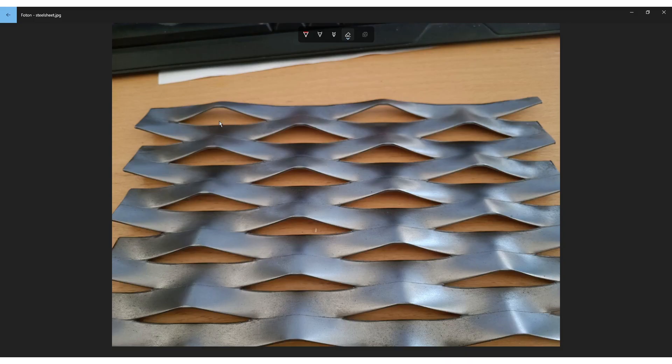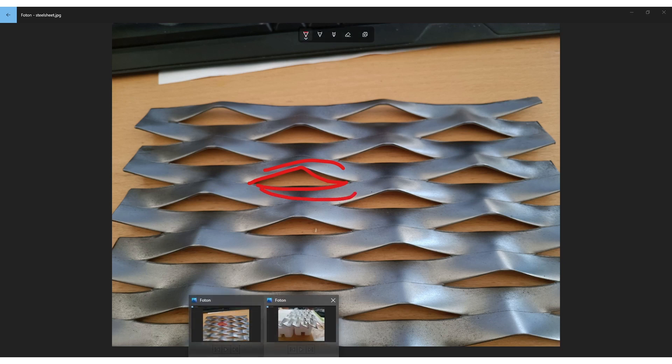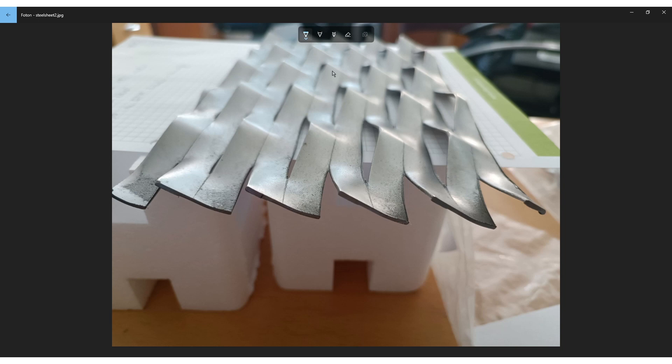Let's have a look at the images first. This starts off like a sheet metal part - these openings are angular openings that are punched out. You can see this shape is a bit different, highlighted with red marker. Looking at this shape here and the shape at the bottom - they are a bit different. I'm going to be a bit lazy and make these two the same. This shape here is a rotated image of this shape down here if you look from the side. There's a triangular bend here and then there's a bend here, that's how I look at this.